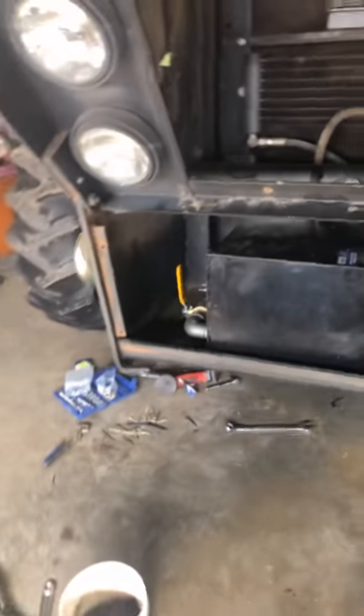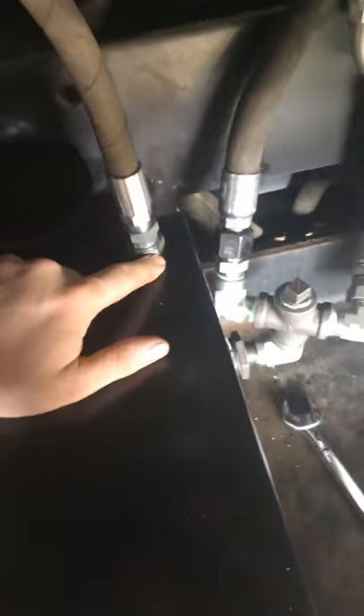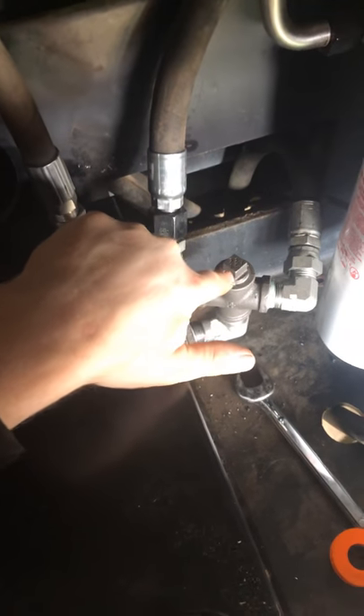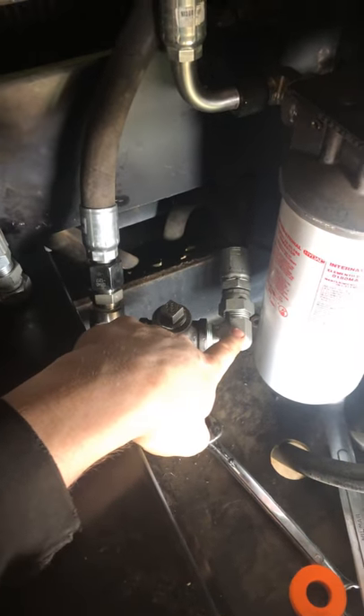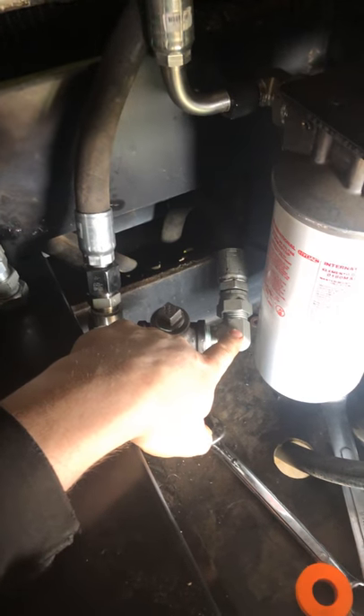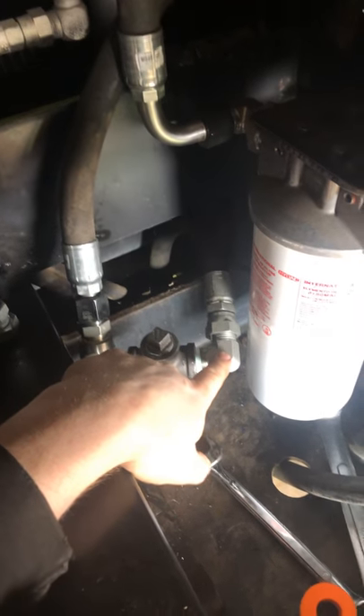And the completed front end here — we'll go up and have a look at that. What we got here is oil tank case drain line separate. I originally was going to put it there but then I got looking, because this is exhaust oil off the flow control, so that very well can be coming in with pressure.